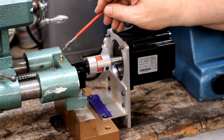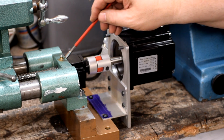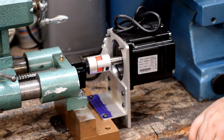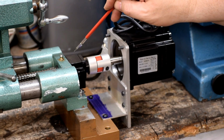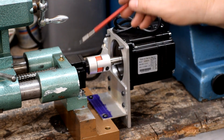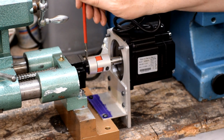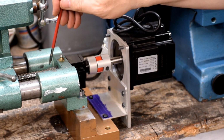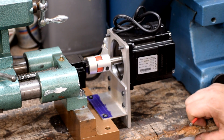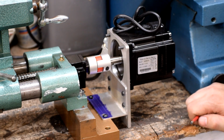This here is just a bushing inside here with a grease fitting that just fits on there. This is the standard way you mount that, is with a bearing. So I've actually kind of done a belt and suspender sort of approach where I have a bushing here with grease, and then I have the bearing block that captures on the end. This is just screwed in like that and locks it in place. This nut holds the bearing down, and it also tightens up between here and here. So this whole thing, there's absolutely zero backlash in this system whatsoever.